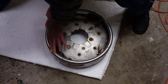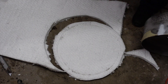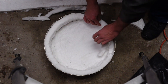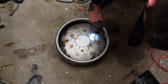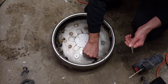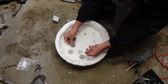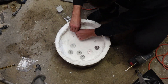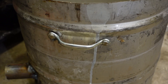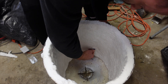Now it's time to cut the ceramic wool for the lid. I should have known that since I had a two-inch lip there, I would need at least that much to cover the whole thing — I cut it a little short, so I had to splice a bit in to fill the gap. I use my drill to drill a hole through the ceramic wool so the bolts slide in easier. Remember, any metal inside the chamber needs to be stainless steel — if it's galvanized or anything else, it's going to oxidize and scale away very quickly. Stainless is your friend, unless you're drilling through it.